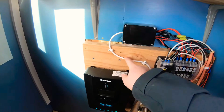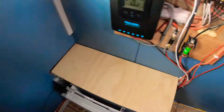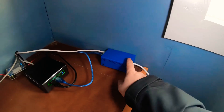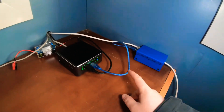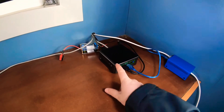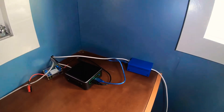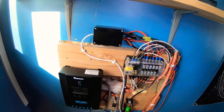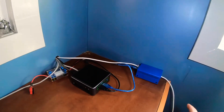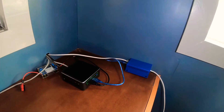This whole box is controlled via Cat 5 Ethernet, which runs down into this Arduino. The Arduino is plugged in via Ethernet to my main network switch, and also via USB into the NUC. It creates its own web server on the network and allows me to power cycle individual circuits — four circuits — on and off from my house, from within the network if I'm VPNing in, or if I'm here on site. It also allows me to measure the voltage of the battery pack via that voltage measurement circuit, so I have a constant web server I can access to check that information.